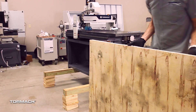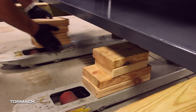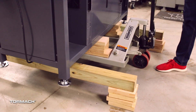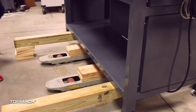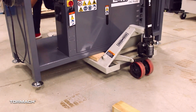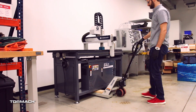Slowly remove the pallet from under the machine. Use blocks as needed under the machine frame. Lift the machine off the supports with the pallet jack. If you see the machine tipping, lower it and reposition the blocks to evenly distribute the machine's weight on the pallet jack. Once the weight of the machine is fully supported by the pallet jack, lift the machine off the supports. Repeat until the weight of the machine is entirely on the floor.